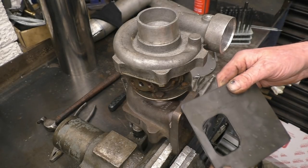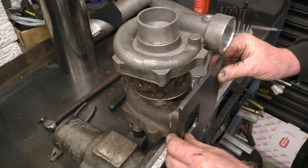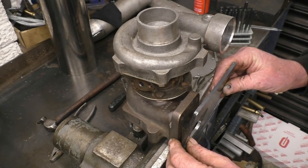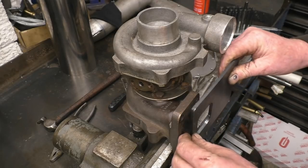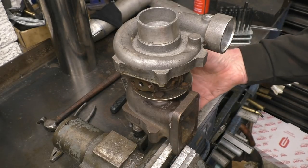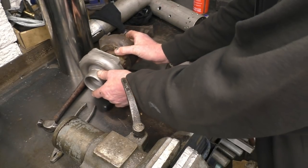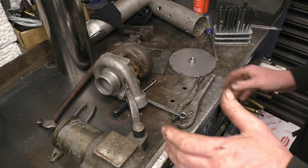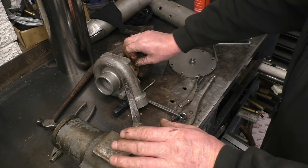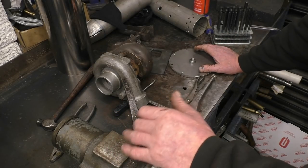I've made this part here bigger than needed because I'm actually going to put some holes in there and use that as a mounting point to mount the turbocharger into a test stand that we've got to build for it. I'll drill those holes now and put that in loosely - these are starting to take shape a little bit. I haven't been able to spend as much time on this project as I really wanted; life's getting away a little bit, but hopefully in the next 12 months I can get stuck into this project and plenty of other ones.